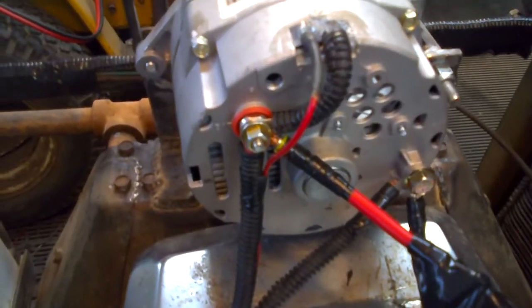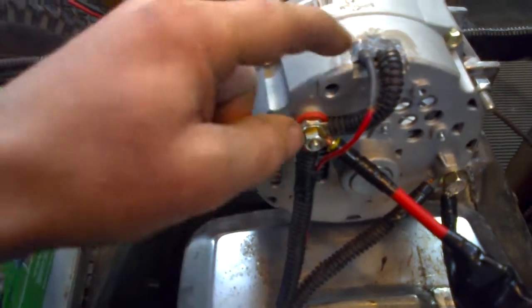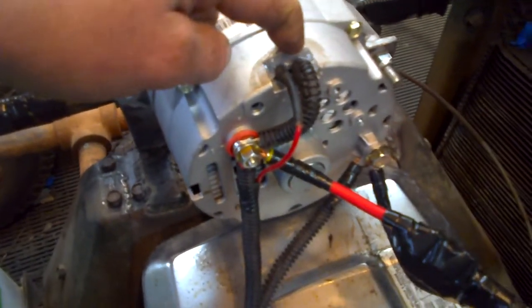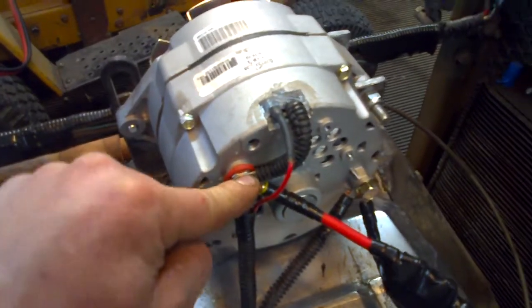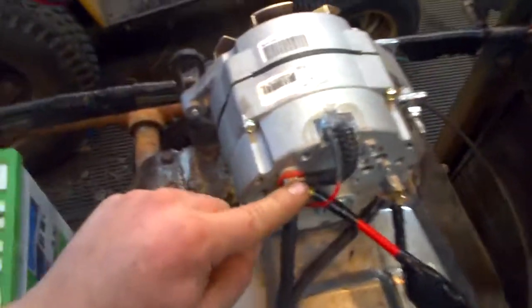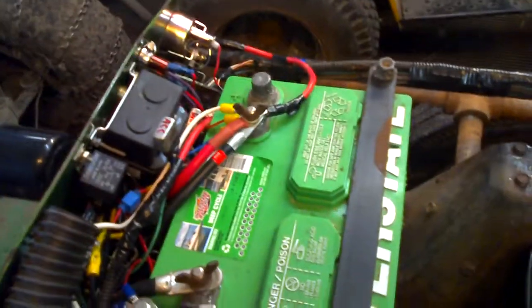Round of wiring - this is a 3 wire setup, so basically you've got 3 posts: your battery terminal, your field terminal, and your regulator terminal. This wire right here is your sense wire, really. It tells the regulator what the voltage of the battery is at, in order for the alternator to regulate the power at approximately 14.4 volts. So this wire gets power off the battery typically.